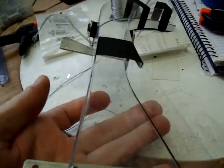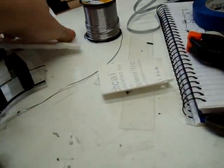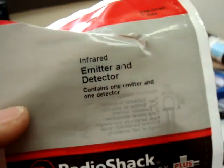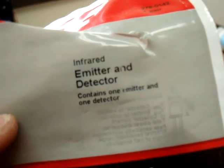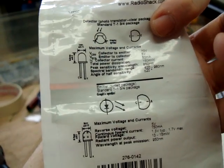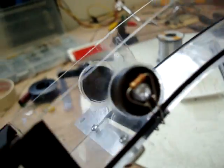Since there's really not much room for switches, I'm using optical sensors. I've gotten one of these infrared emitter and detector pairs from RadioShack. RadioShack's not the cheapest place, but you know they'll work together and you even get the schematics, so why not? I just used some extra pieces of acrylic I had laying around to make these little sensors, and the ball passes through.